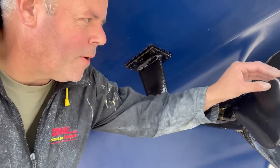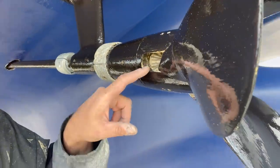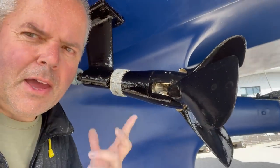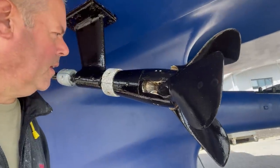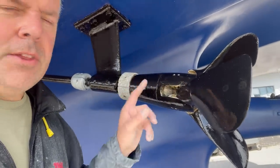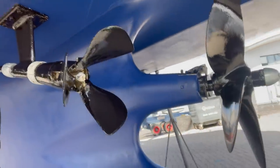I've picked up an extra job I didn't know I had to do. These are the wing propeller blades, and in here there's supposed to be a rubber bushing which stops the blades from going too far forward and stops them making a big clunk when they operate. One is turning up Monday hopefully, and if it does it'll be fitted. In order to fit these bushings the blades have to come off, so I'm not going to grease it up just yet.